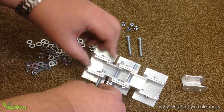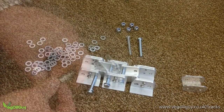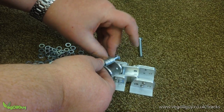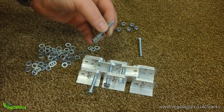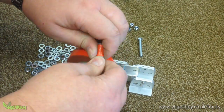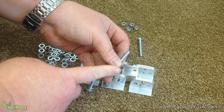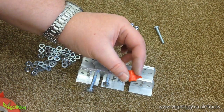Inserting the washers that form the rollers can be very fiddly. My fat fingers struggled with this. But here's a handy tip that will save your sanity. Count out the number of washers you need and place them on a spare bolt. These should fit comfortably between the gap in the smallest U channel. Using some tape, enclose all the washers and leave a scraggy end to make removal easier. This roll of washers is simple to insert.